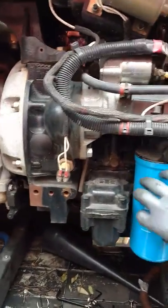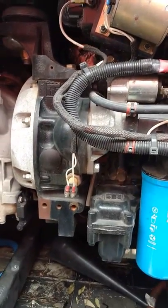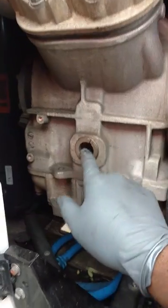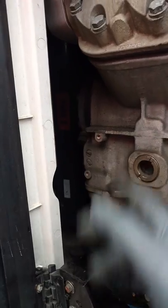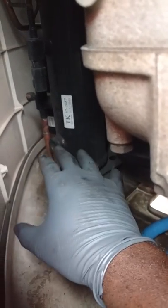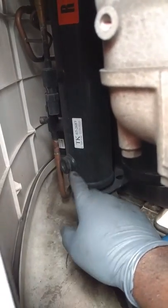Oil filter, starter, starter solenoid, speed control solenoid that helps gauge the RPMs. This is your compressor — the main heart of the engine pretty much. Over there is a sight glass for the refrigerant, like a recovery tank. If that thing is low, it'll give you a code and sometimes it won't crank during system checks. There's a little bubble sight glass in there — if that little ball sits at the very bottom, it's showing it's low on refrigerant. You can't fix that yourself; you have to take it in and let them charge the system back up. It normally shouldn't be going out unless you have a leak somewhere.